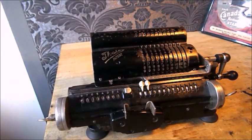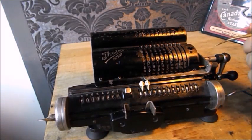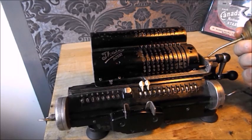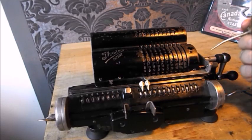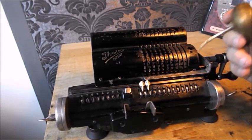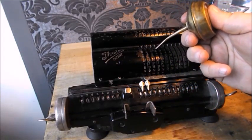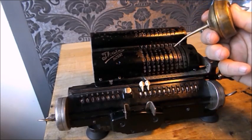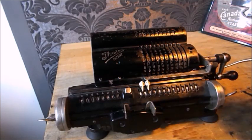Due to its age and extensive use, the machine is a little worn. She's just an old lady. The machine needs to be oiled before use. These calculators are the only computers that should be lubricated with acid-free and non-resinous oil. The average precision mechanics oil that you can get anywhere will suffice. It is best to oil the machine wherever the gears and slides touch.